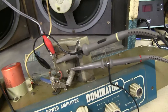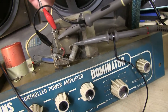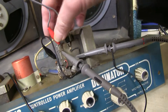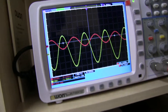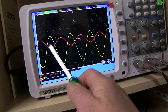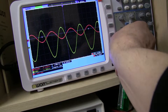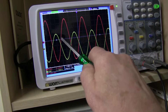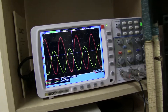Anyway, testing this out - it's still the original transformer. If you put the signal where it should be, which is between the earth and the 8 ohm tap, and just move the earth to there - now looking back, you've still got the 10 volt input signal, the yellow one, but the primary one's gone right down now. If we just increase sensitivity a little bit - 20 volts per division - 20, 40, 60, 80, 100, 120, 140. It's about 150, so 15 to 1, as I showed previously.